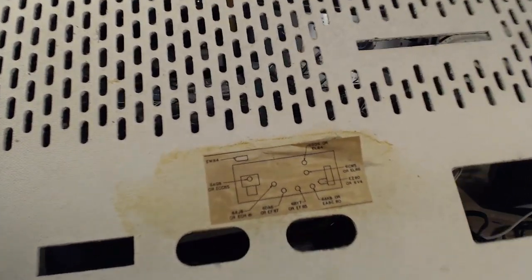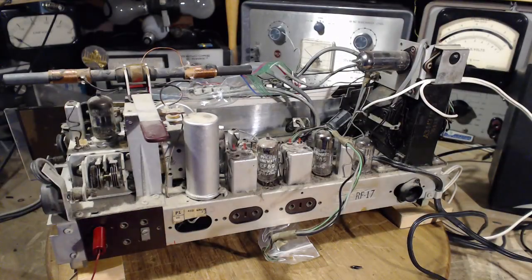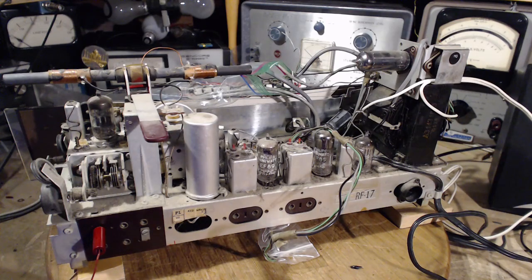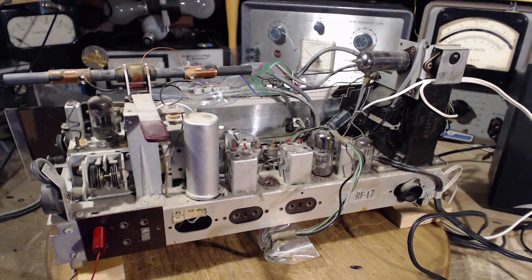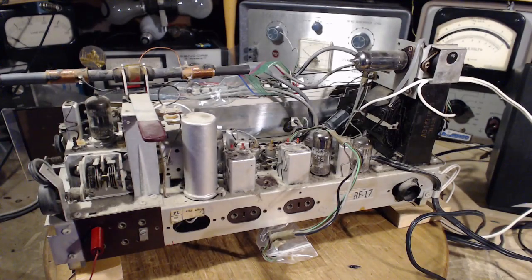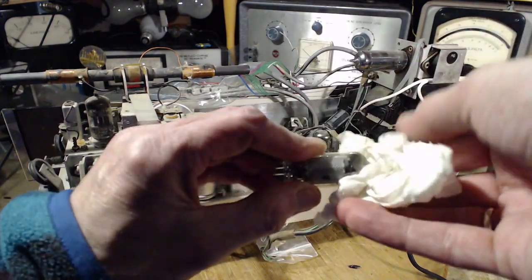Now you could pull the tube out, you can't read the tube name on the tube anymore, so you look at the information. You trust the sticker on the back of the radio more than anything. Presto, you make a mess of your radio. Okay, so it should be an EF89. You think tube testing must go along pretty straightforward. No, it seems that it never ever does. It's always some tricky stuff going on.